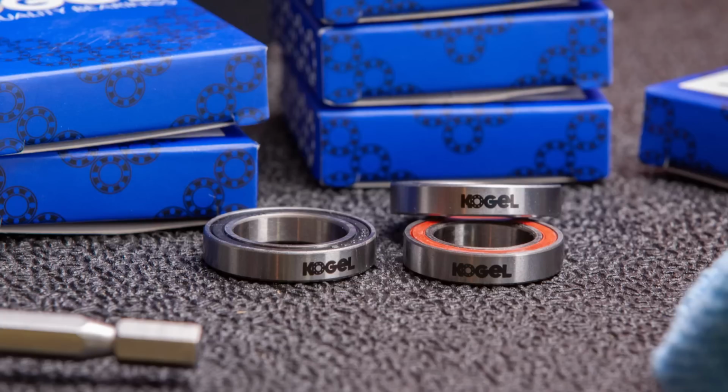So this is the bit where the balls have contact in the bearing. Chrome steel has great wear life, but the flip side of this is that chrome steel is more susceptible to rust and corrosion. So the opposite side of that is stainless steel, which is pretty much impervious to moisture. So it's perfect if you're looking to minimise corrosion. However, it is softer than chrome steel, so durability becomes more of an issue.